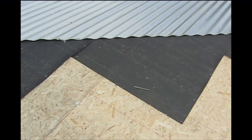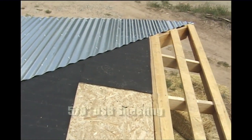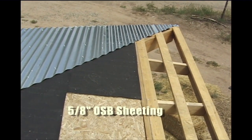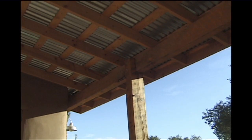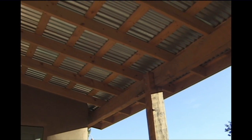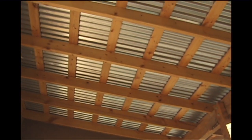Three different elements make up the final roof assembly. First, a layer of OSB — oriented strand board — is screwed into the trusses. This is followed by a layer of roofing felt, also known as tar paper. The final layer is corrugated galvanized metal sheeting. Note that the OSB does not continue into the roof overhang — one by four lumber was used instead, purely for aesthetic reasons. The wooden slats, with the exposed metal roofing in between, created a much nicer effect than solid OSB sheeting.